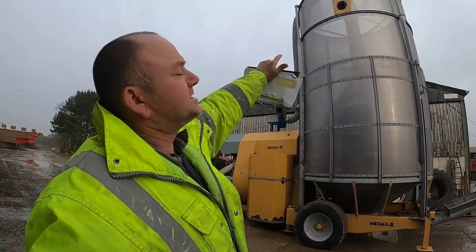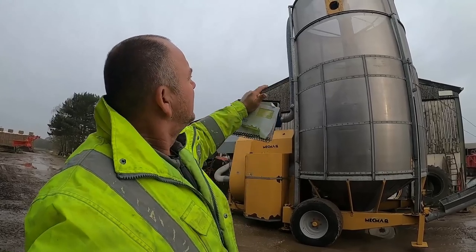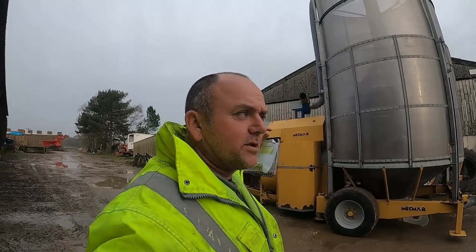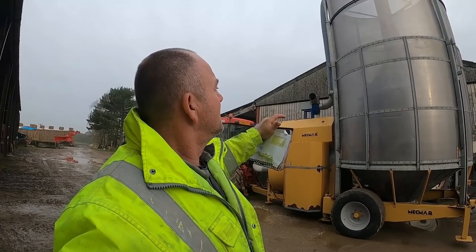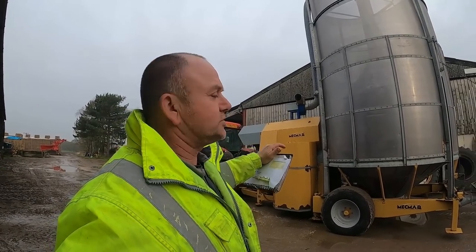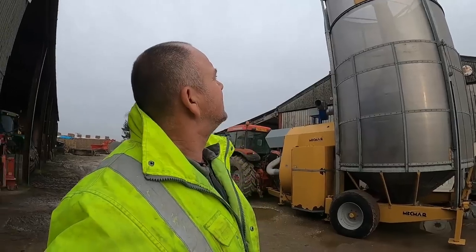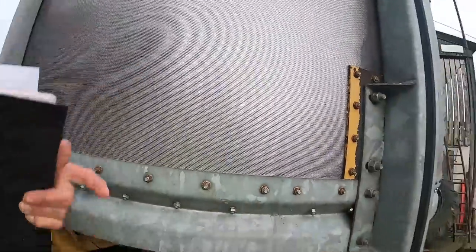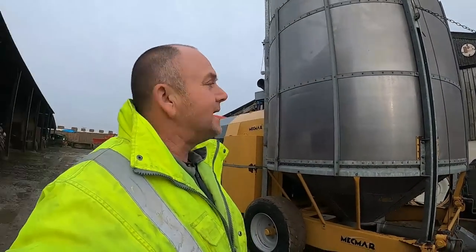But you have to wash these off from time to time because all the mesh gets filled with crud, and it'll only breathe through the top, you know what I mean, to let moisture out when the blower's on. So we give it a right good wash off. It's probably twice a year, because if you see this meshy stuff, it fills with dust and it can't let the hot air out, what you're blowing in.